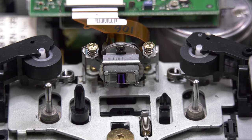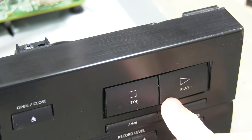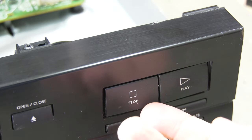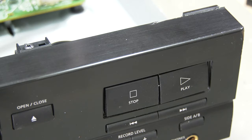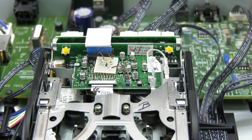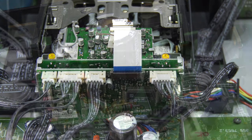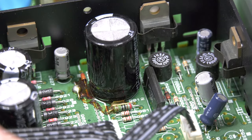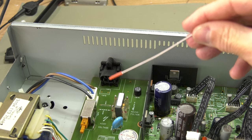Other than that, this trial run is the same. Let's address the potential problems on any DCC 730 or 951. The stop and/or play button sometimes is loose or broken. Capacitors are usually okay on these units, but potential problematic areas with SMD capacitors are on these two boards. The glue shown here is often mistaken for a leaking capacitor. Most 730s and 951s need re-soldering in these areas.